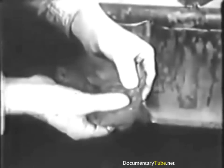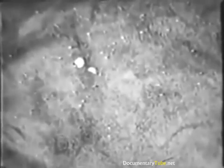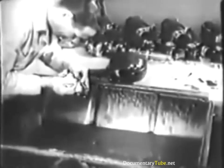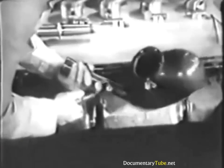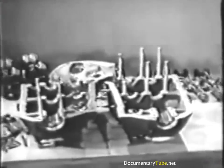Before cleaning the oil sump, make a careful search for metal particles that may have chipped off the engine. Wipe out the inside with a clean rag. Loose particles of metal might be a clue to serious trouble — if you should find any chips, determine the kind of metal and look for the cause. Clean every part you've disassembled with equal thoroughness. Cleaning of all the engine parts not only makes your inspection more efficient but allows you to check clearances with greater accuracy.